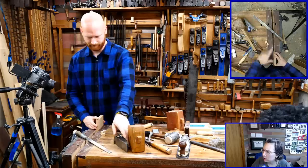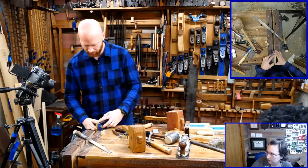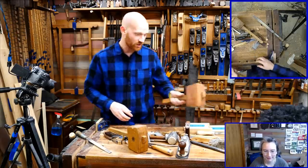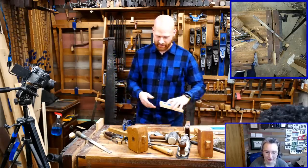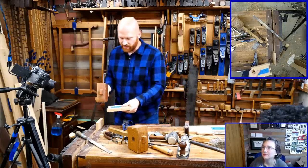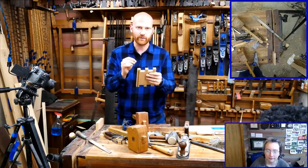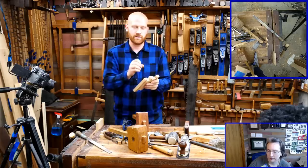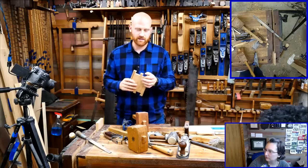Moonwolf71 asks, do you undercut to leave wiggle room when you go to put the joints together? Yes, it is better to undercut than to leave it proud. Because if you leave it proud, you have to come back and clean it up. And leaving it proud just a little bit causes all sorts of really bad issues. Because if it's proud just a little bit, it becomes very hard to see that it's proud. And in doing so, when you go to fit it down in there, everything looks good. And it looks like it should fit. And you start to tap it. And then suddenly what happens is your board splits. Because it's a little bit proud halfway down, it's going to be putting force in there. So it looks like it fits, and everything starts to slide in, but the moment you tap it, your board's just going to crack apart because it's literally a wedge in there because it's fatter halfway down. And that's something you just can't see.